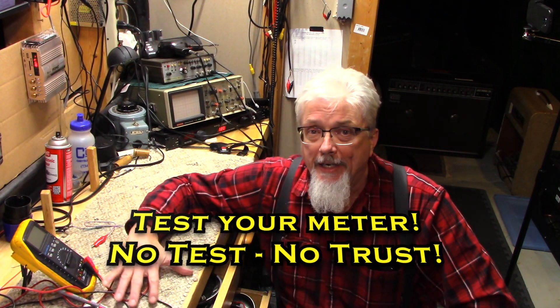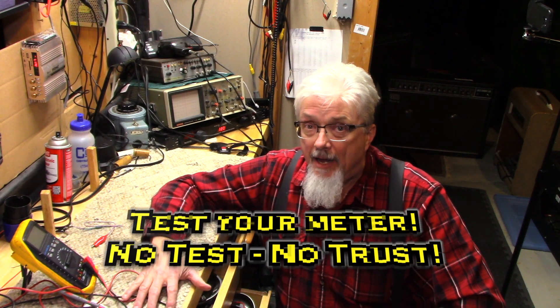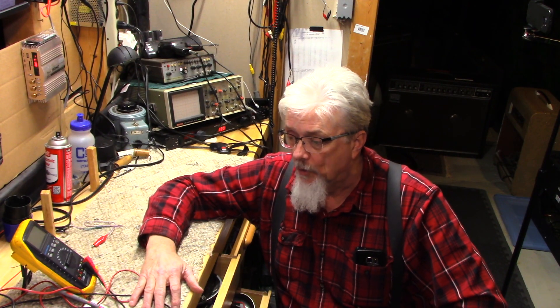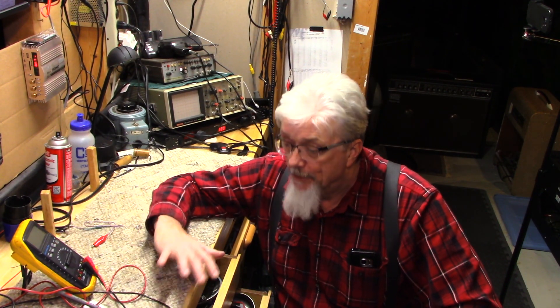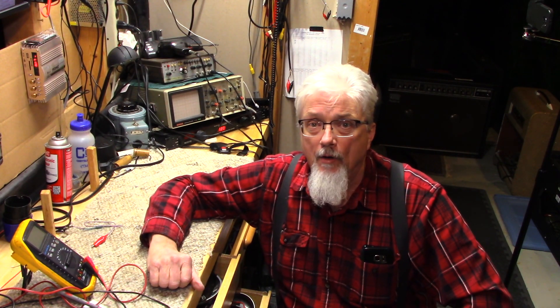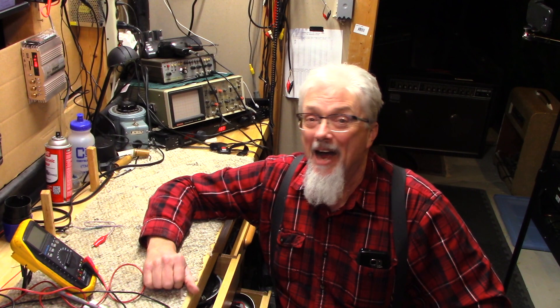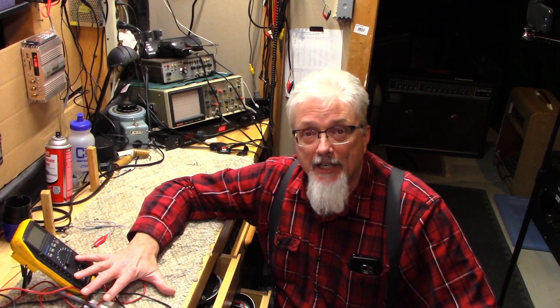If you get no reading at all on your meter when you hook it up to the high voltage of an amp, you may want to double-check the meter in another area to make sure it's working. All of this stuff is available online in electrical safety references. That's pretty much all I'm going to cover for now, and hopefully I'll always use safe practices when setting an example. Thanks for watching — next video I promise we're actually going to work on an amplifier. See you soon.